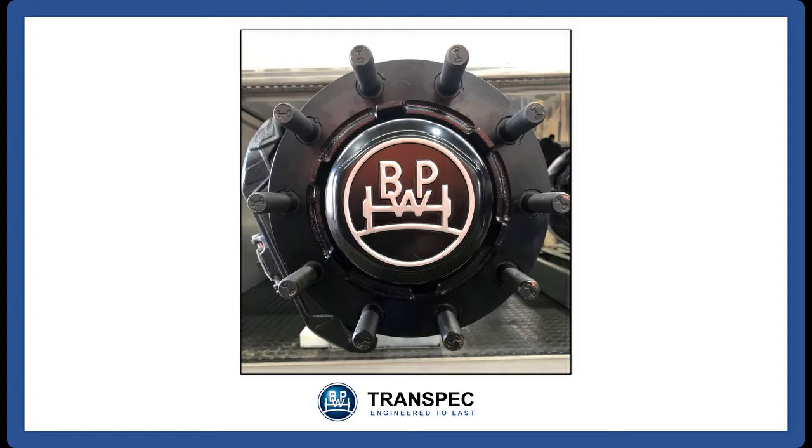BPW axle hubs are identified by their hubcaps. The Eco Plus 3 hub design has no version indicator on the hubcap, simply the BPW logo. The thread is on the inside of the hubcap.